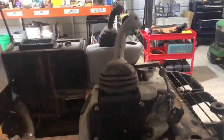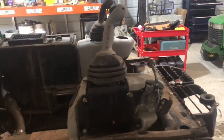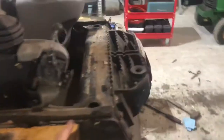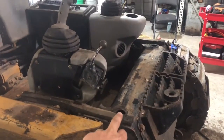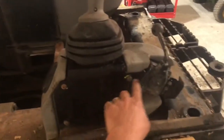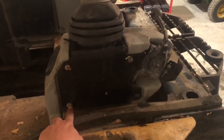I'm gonna share with you what I wish I knew before I started. Right off the bat, flip the cab — it's easy to do on these Cats. Take the two bolts out that are right here, that come out of these studs right here when it's down, pop the thing up, and then you can get to everything. Take these four torx screws out — they're a T25 or a T30.